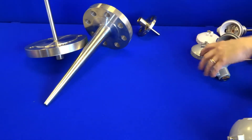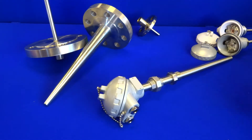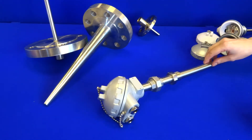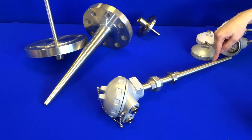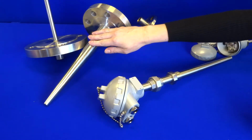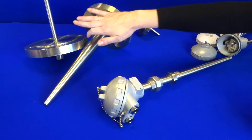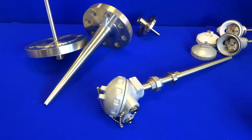Next we have the heavy-duty range. In actual fact this is identical to the medium duty, but here the thermal well is solid drilled and machined from bar stock — I have another model here to show you. It can either have a parallel or a tapered stem, which can offer greater integrity and is suited to the more demanding processes such as raw material handling and incinerators.